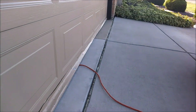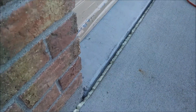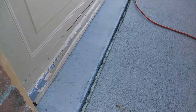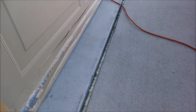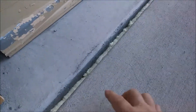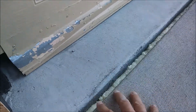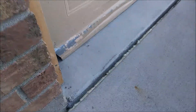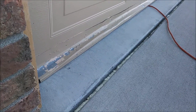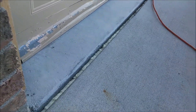I put in one can of quick foam — that took almost a full can from one end to the other. I'll let it fully expand over the next hour or so and see if I want to add more. I definitely don't want it foaming out over the top of the crack because then I have to clean up the edges. The goal is to bond to both edges for the first half inch, with the rest of the depth filled with something consistent, waterproof, and sticky enough to make a seal.